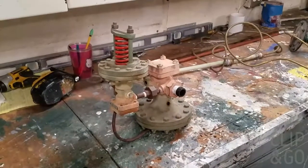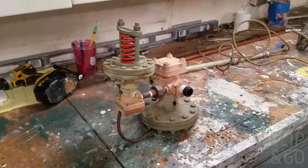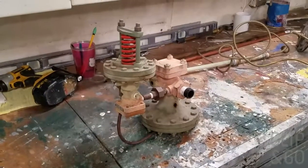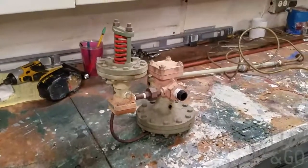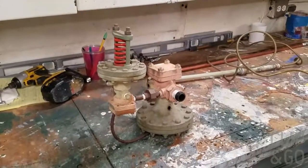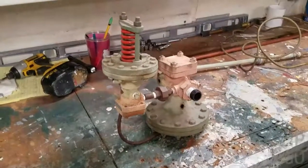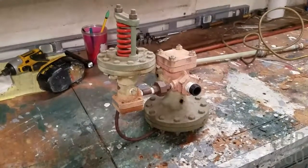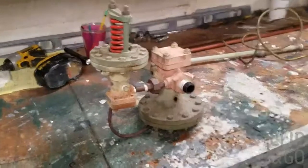This district steam in New York City is used for heating buildings and radiators, hot water, and the really high pressure steam is actually used for absorption chillers. So there are no electric motors, and the steam turns a turbine which powers the centrifugal chiller. Those are in the big commercial buildings. Also, some buildings do use backup turbine steam generators. So the steam does have a lot of use. It is very expensive, though. The way it comes in, it's metered like gas, so you do pay a monthly fee for it.